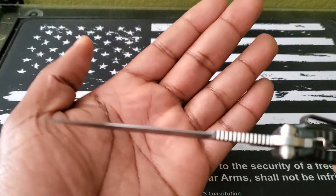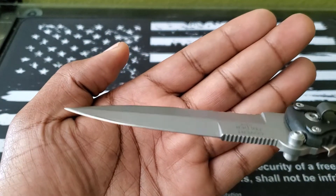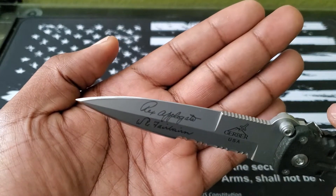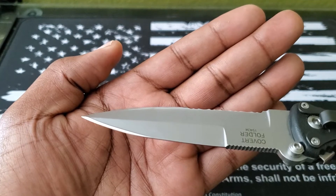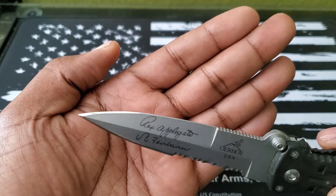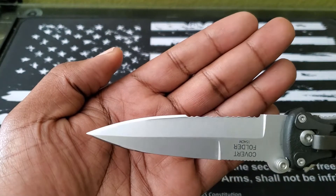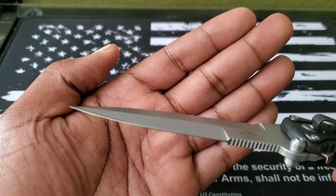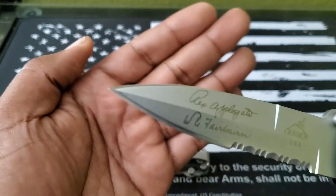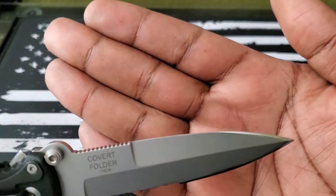The fact that this blade stock is so thin, it didn't take me long at all. I'd say it probably took me about 15 to 20 minutes. I started off with a really coarse stone, moved up to a thousand, then moved up to 4,000, and then just stropped it. I didn't really feel the need to go any higher in grit. And this thing, man, I tell you, it came out pretty well. I don't think it could be any more even.